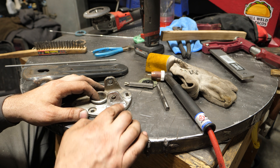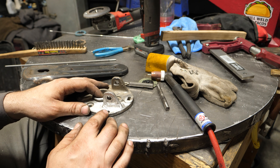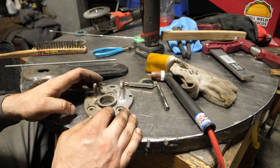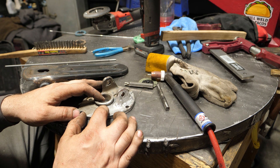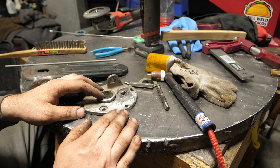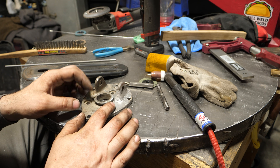This is a typical cast aluminum repair — it's not pretty, it's not perfect, but given the base material and how well it actually did weld, this will be a lasting repair. It far beats paying $700 for a new assembly. That's one of the great things about having an AC TIG welder — you can do repairs like this and save yourself or your buddies money, or make money doing this. It's only about a 45-minute to one-hour job, and I've done plenty of stuff like this for $100 to $125 cash, saving someone $500 to $600 bucks.